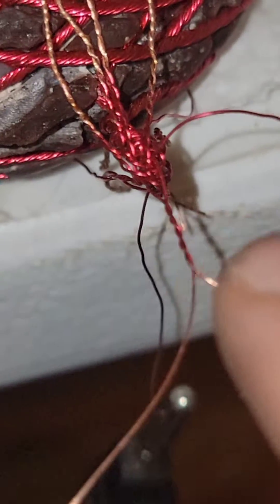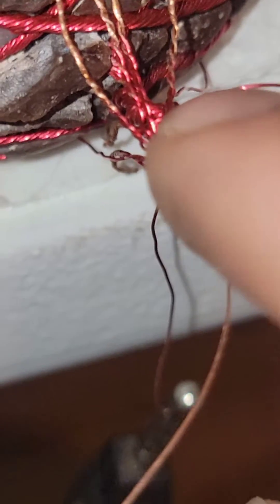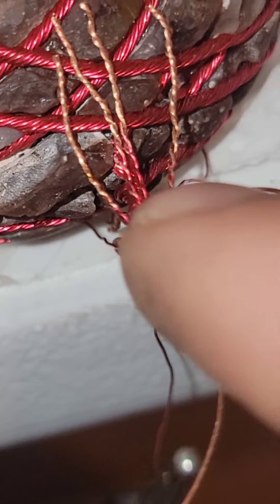As you can see, I'm leaving a little bit of enamel at the base. You can kind of see where all these wires are. If you don't leave enough enamel at the base, all these wires here are going to short out and touch.